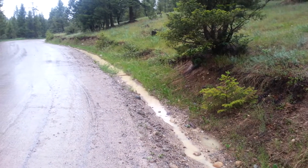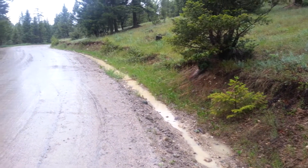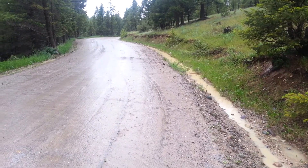What you can see happening here is we've got this diversion ditch on the side of the road, and the water is getting pushed all the way around this road and getting concentrated — which means that this road is actually acting as a dehydration element for the forest downslope.